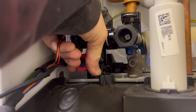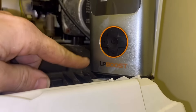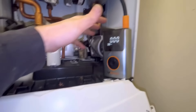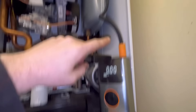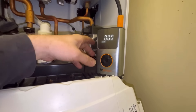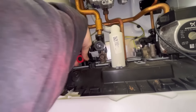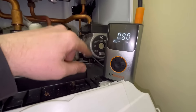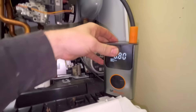Water's nearly all out the boiler now. I'll give this a try - I got it off Amazon for 20 quid, it's called Up Boost, it's a little portable air inflator. I just thought I'd give it a try, why not. I've set it to one bar, turn it on. All I've done is keep the PRV off and manually with my fingers let that go to around one bar - it dropped a little bit so I'm just making sure that vessel's okay. That was an absolute steal for 20 quid, and it fits in my velocity bag.